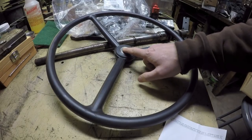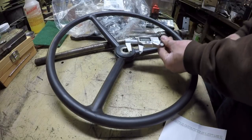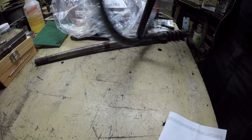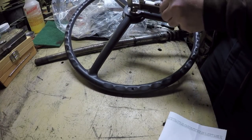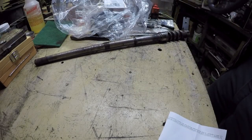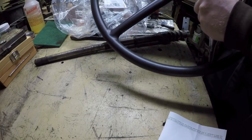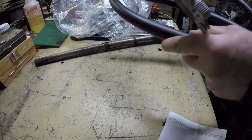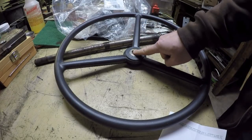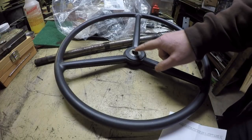The first thing is to double check what we're dealing with. According to the Tractor Supply website description, this is a three-quarter inch hub. However, if I set my calipers to 750 thousandths — which is three quarters of an inch — they won't go in. But on the backside, it goes in with room to spare, so it is tapered. On the positive side, that's actually good because when the nut is tightened down, it's going to drive that taper in and give it more holding power. In conjunction with the keyway and the taper, that adds strength, as opposed to a straight shaft where all the torque would be focused on the keyway alone.